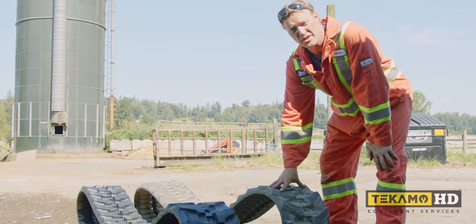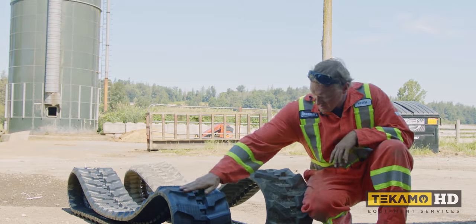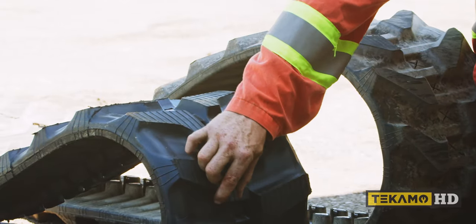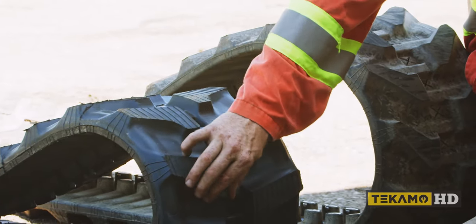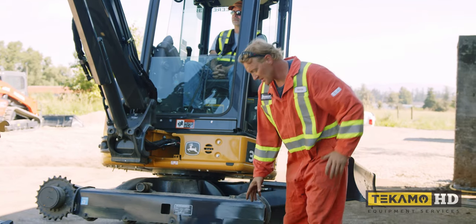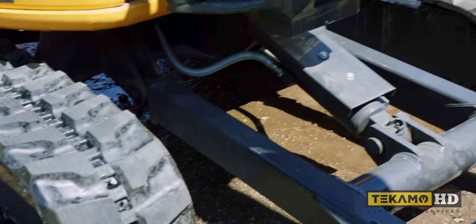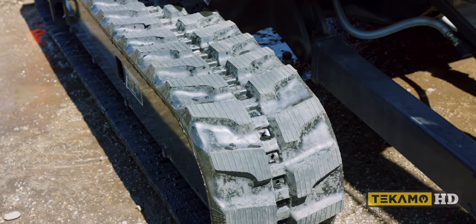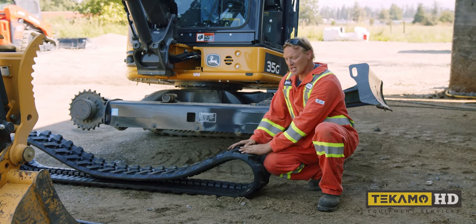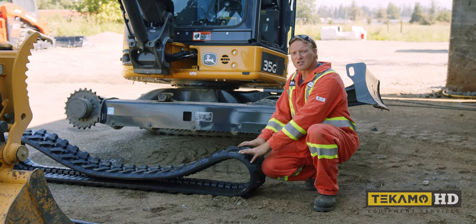We've gotten our track off. This is the factory John Deere track that came with the machine, and this is an aftermarket track. There are small differences — there are little lines on top of the lug pattern here that will wear off quickly. I notice this aftermarket track has a little more shape on the leading edge of the lugs compared to the factory one. All rubber excavator tracks are directional — the lugs V towards the middle in a forward pattern. When you get into really soft material and the track spins, you want the mud to get forced out of the track for traction, not act like a paddle and scoop mud in.